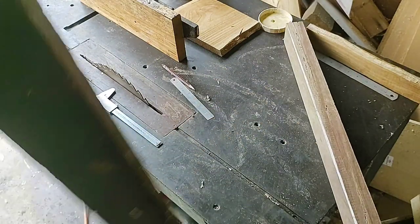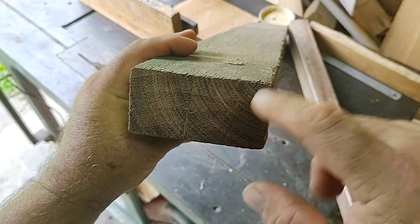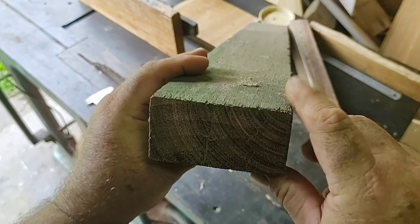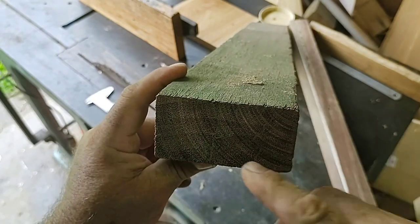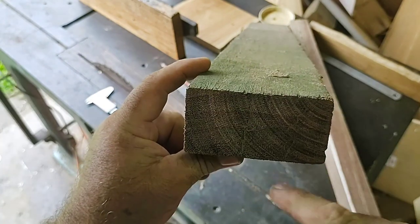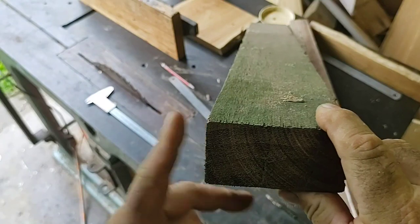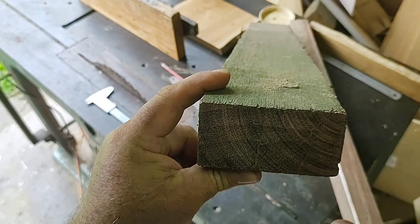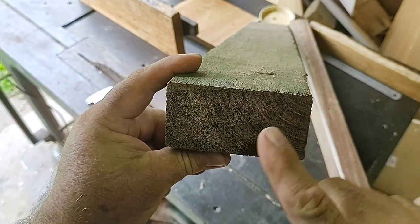this piece of timber here, see if you can see the grain. See how the grains go around? Now, the heartwood would have been here. I would avoid this particular piece of timber because it's close to the heartwood, yes, but not only that, the grain is more crossways to what I want, so I'd find it would splinter away. And you can even see the cracks coming out from it on the end grain here, how it would go. So I would avoid that.